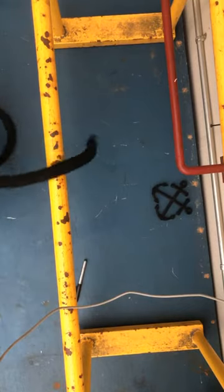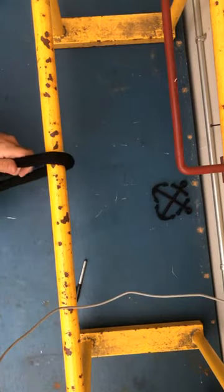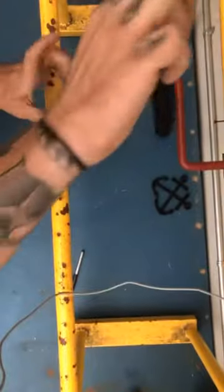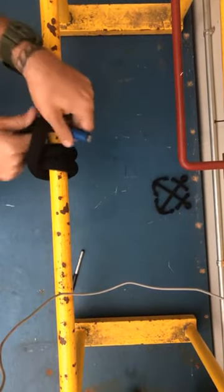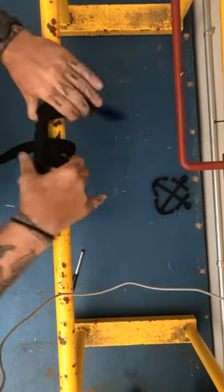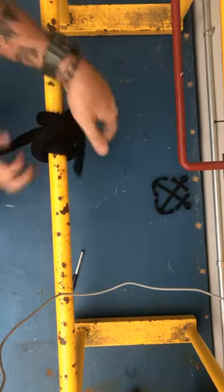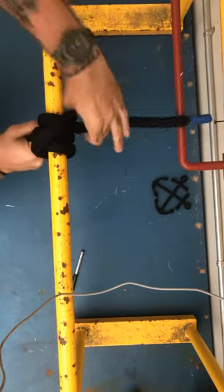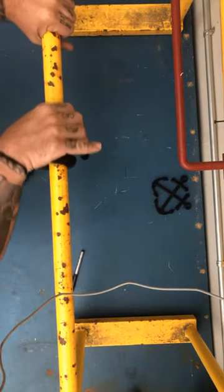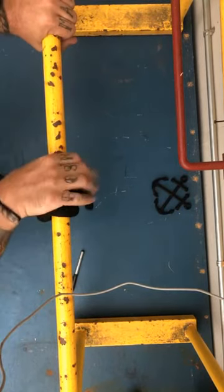What the Coast Guard calls a stopper hitch — another variation — I come over here, make a round turn, come all the way around, then cross over like I'm making a clove hitch and come back through. Bring it together. For those looking at diagrams, a lot of times you'll see it looks like that when tightened up. My direction of pull — you can slide up and down, it'll hold. Take the tension off, I can slide it.